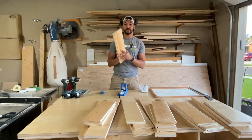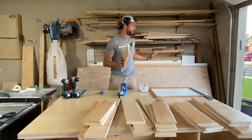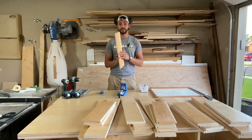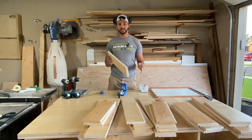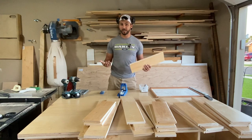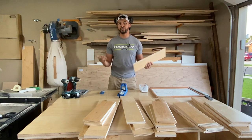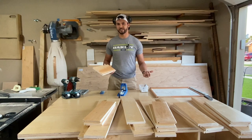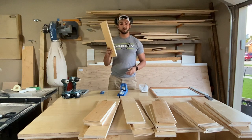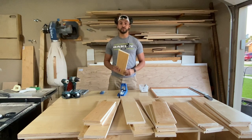So we've got our grooves cut. They fit what's going to be our base, which is just quarter-inch plywood — they fit those perfectly. Off camera, I went ahead and rounded over both sides of our drawer boxes just because you'll be going over those a lot as you reach in and out of the drawers. It's nice to have a nice round-over edge so you don't get scratched or get splinters. I don't do the front and back because you don't really touch those edges ever. So with that said, we can start on our first method of pulling these drawers together.